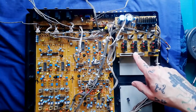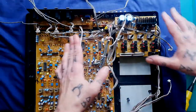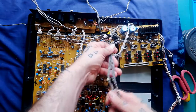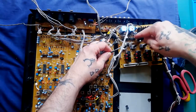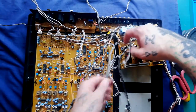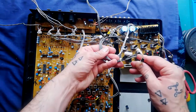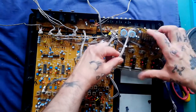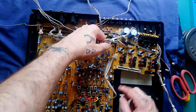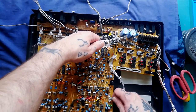Next, let's remove the Q volume PCB — six screws there. Getting this out of the way gives us a clearer picture of where all the cables that were attaching to the mixer went. We can now see two cables more clearly: one just below this Toshiba chip and one on the edge — both were going to the mixer board, with four-pin and eight-pin headers at their ends. The longer of these two cables, behind this capacitor, is going into this socket, and the one in the bottom left is also going into the record playback circuit board.